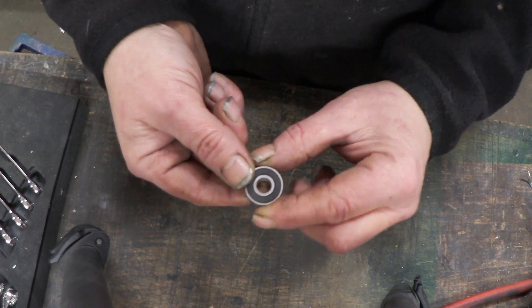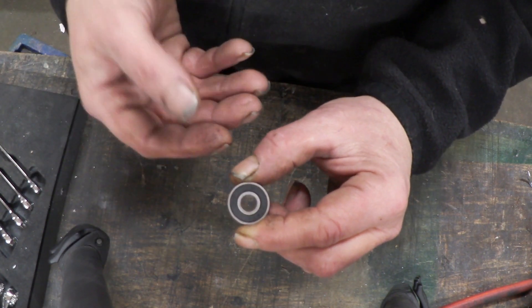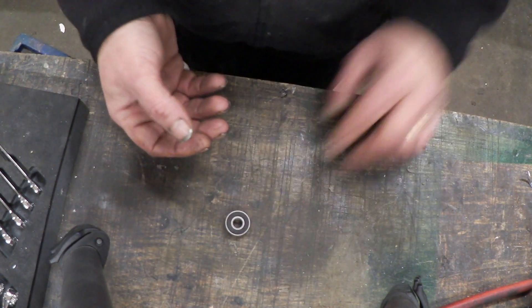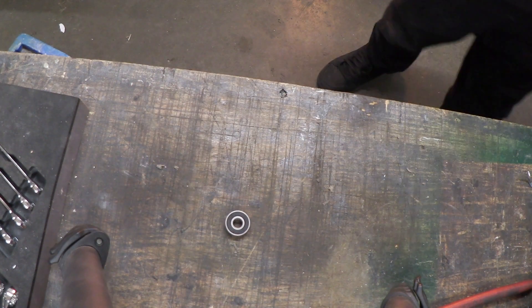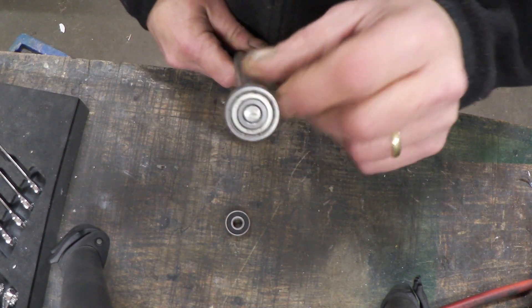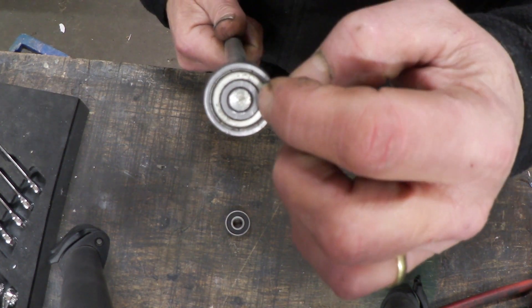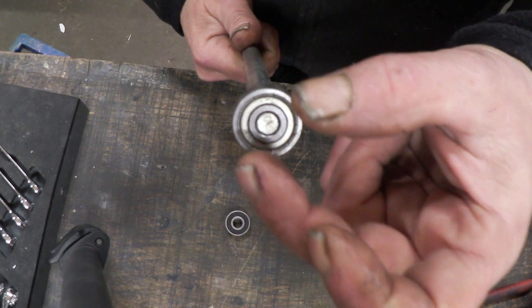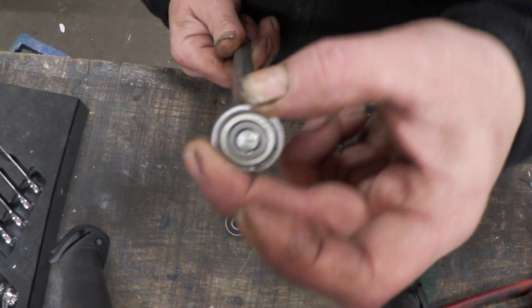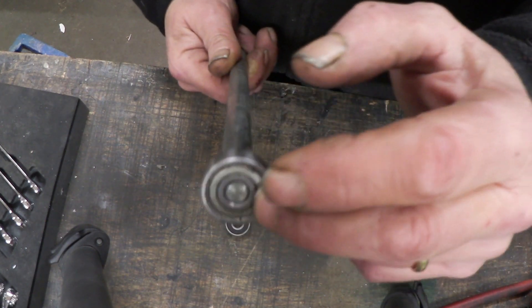This will work just fine as long as it's not too much weight — a few kilograms or so. Those whirlybirds only weigh a few kilograms, so it's not a standard way but it is a way of doing it. I've got a piece of bar here — 12 millimetres, turned down to 8 millimetres — and there's a cone at the end so the 8 millimetre section goes to the centre and the cone rests on the inner ring. If I rest the entire rotor only on that outer ring, it will be free to turn with all the weight taken on the ball bearings in between.